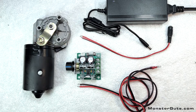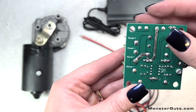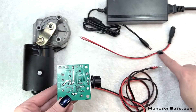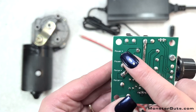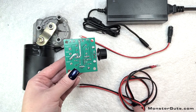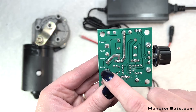It's very easy to assemble. On the backside of your speed controller you'll see it marked. You're going to connect your power quick connect — red goes to power plus, black to power negative. For your motor quick connect, red goes to positive, black goes to negative.